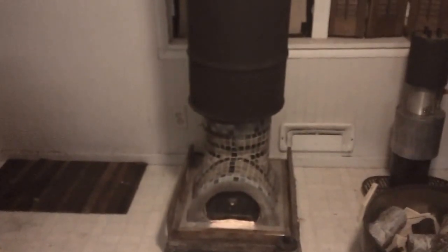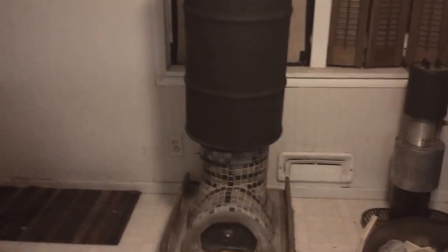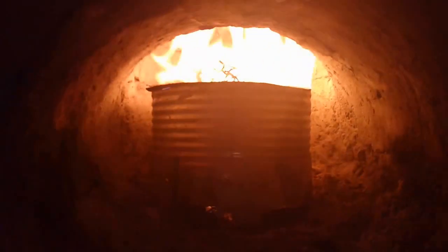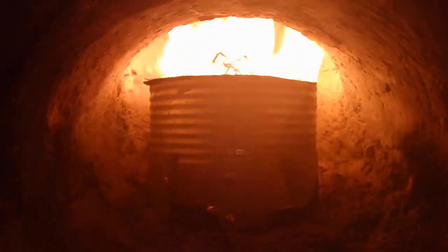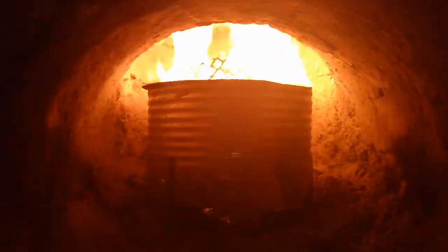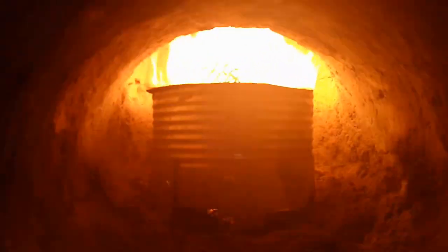That first batch I burned, I quickly learned a couple of things. One, a three-quarter inch hole is not big enough. So all I did was extend my hole out a little bit bigger with my snips and extended my mesh, making the hole a little bit bigger. I also added another mix — same mix — but I put in about one more cup of vegetable oil and probably about three tablespoons of lighter fluid, charcoal lighter fluid. That thing is really off-gassing and putting out heat.